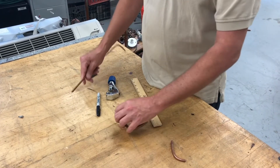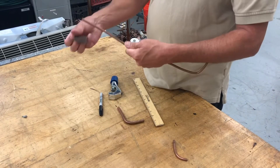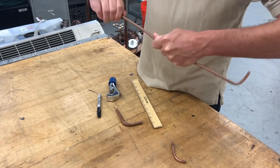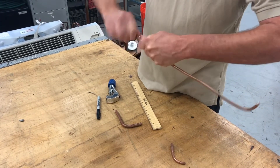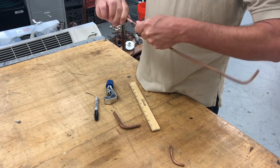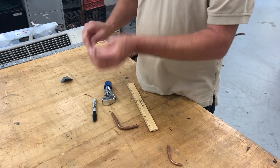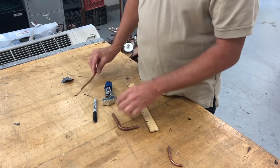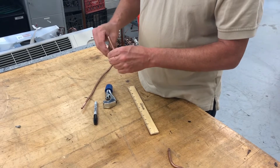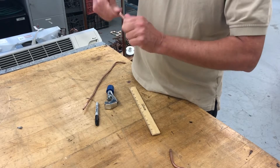I want to make sure we do all the prep both on the inside and the outside of the pipe before we do the constricting. I'm going to go about a quarter inch beyond the measurement — whatever size the pipe is, that's pretty much how far I sand beyond our measurement. I would have prepped the pipe by deburring first; this one's already been deburred. I'm going to go ahead and sand it on the inside.